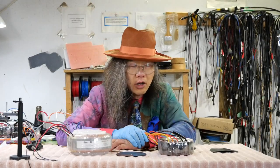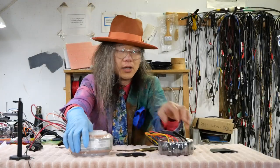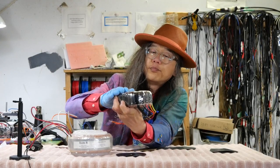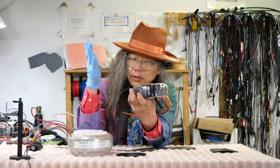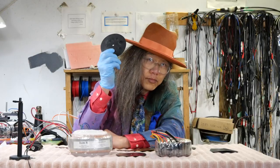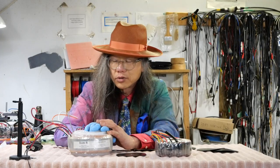That's my main reason for putting silicone on top and bottom of the transformer. As soon as you put silicone on — because silicone is flexible — it will fill out all the empty space. Once you fill out all that empty space, the surface becomes even, and the pressure on the transformer is even. It spreads out across the whole bottom and top of the transformer. It's not just a few points on those wires anymore. The vibration damping is a bonus — you can even feel reduced chassis vibration because of the silicone.